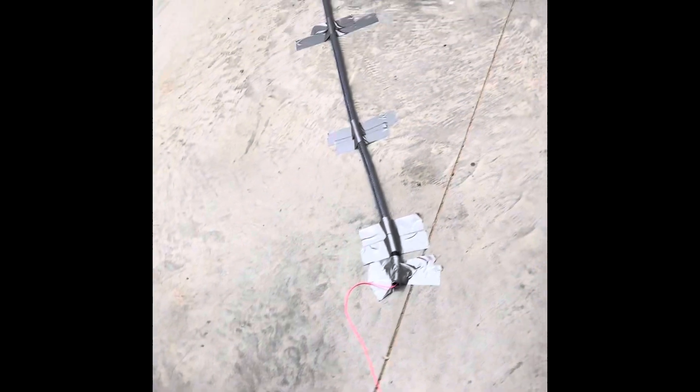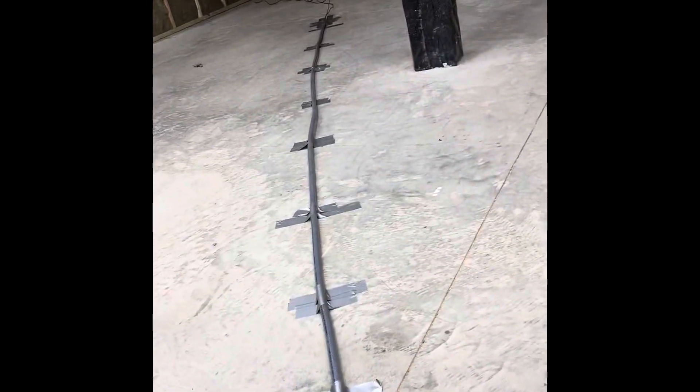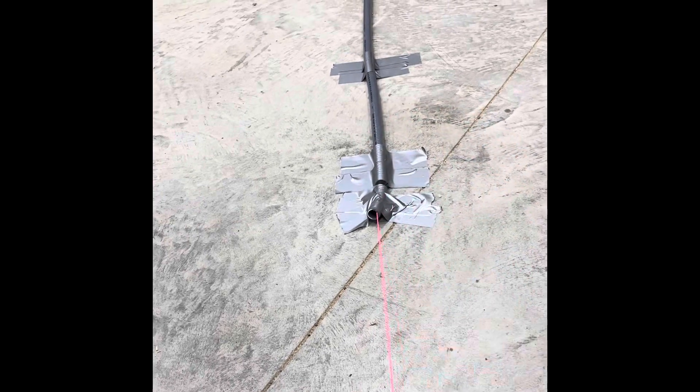Once you tape the conduit down, the difficulty goes away. All of the resistance is because it's curved — when it's curved it grabs, but when it's flat like this it's just this easy. Just a couple of tugs to pull the wire all the way through. We just tug and tug until the wire comes through. Stupid easy — work smarter, not harder.